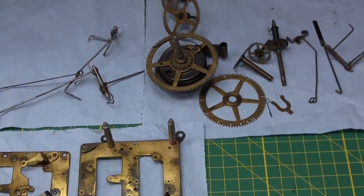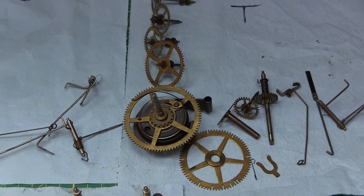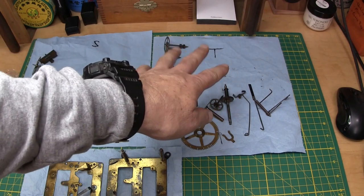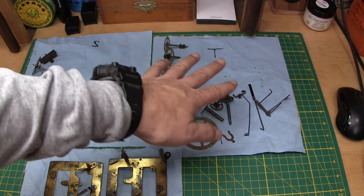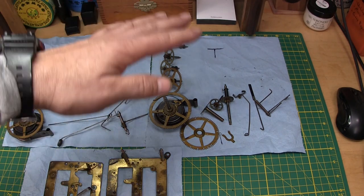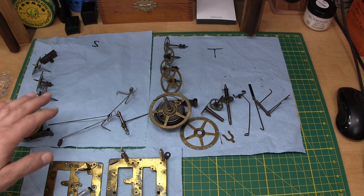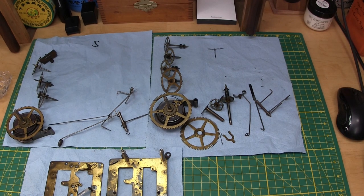There's actually not too many parts when you break it all down like this. As an amateur beginner, I might clean the movement plates, then clean the time side and put them back, then the strike side and put them back, so that I don't confuse anything. As time goes by and you work on other projects and have confidence, you can put everything together in a big basket like the pros do. Or if you have a photographic memory, that might help as well.